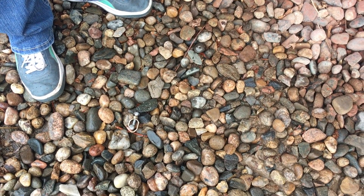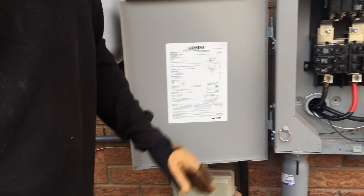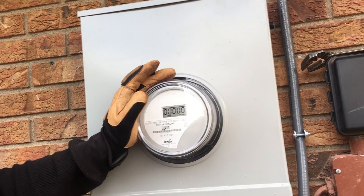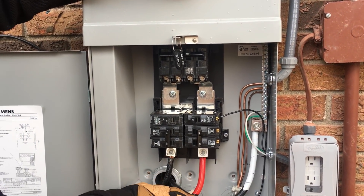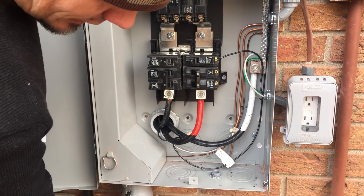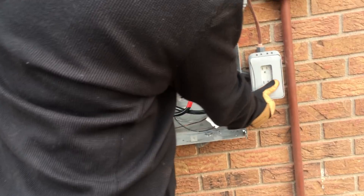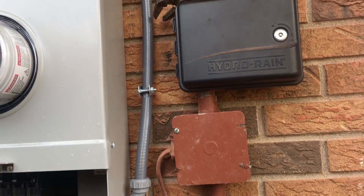We have an inter-system bonding bridge bar and created a cabinet here with an all-in-one bypass lever. We went from 100 to 150-amp and put in copper because they wanted that. This is my old cold water ground, my ground rod, and this was going in here so they must have bonded it somewhere with another ground rod for the utilities. I went ahead and gave them an outlet outside right here because of their sprinkler setup.